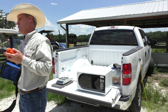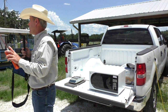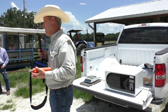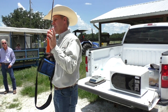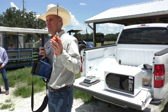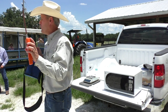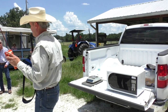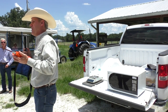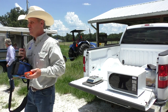For this one, you need to make a really packed sample. There is a different probe with a different sensor that you can stick on a bucket and put inside. Remember, some meters have limitations for the amount of moisture — if you're trying to measure 50%, that may not be a good tool. But most of you have seen this; it's not very expensive, and it's something I think you should have if you bale hay, because sometimes you don't have the choice to use the microwave.